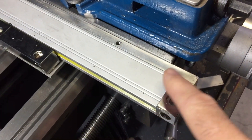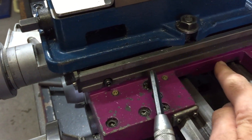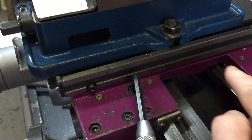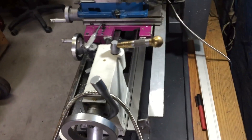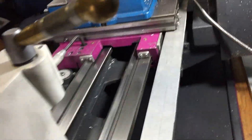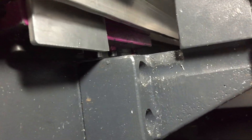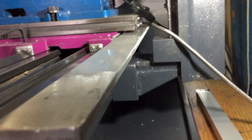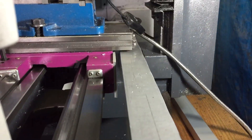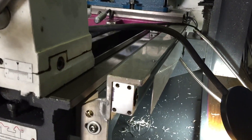The scale is attached to a piece of aluminium, and that piece of angle under there is attached to the bed on the opposite side. There's virtually no room to put scales on this thing, particularly with the mill attached to the lathe bed. There's actually no possibility of attaching the scale directly to the lathe bed as there is no clearance at all. So I've got this bit of 6mm aluminium angle attached out from the bed with the scale attached to it.